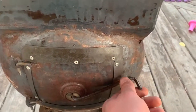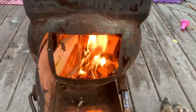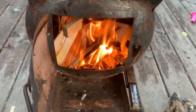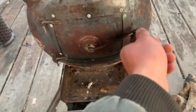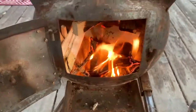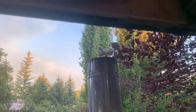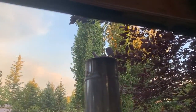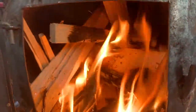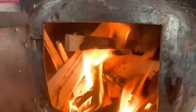Even if you have gaps, even if you don't have gaskets, even if you leave the door open a little bit, the flame just goes right inside the stove and never comes back out. It's been about five minutes or less of burning time since we lit it — I've never touched it. My vent is opened maybe an inch out. The interesting thing is the smoke coming out, you can barely even see it on camera because it's so clear. That has a lot to do with the secondary combustion chamber, which is letting the smoke inside burn off enough to not produce any visible smoke.